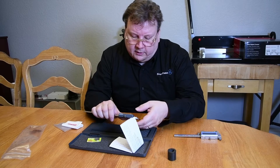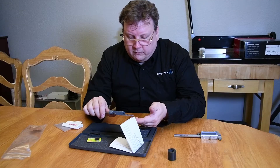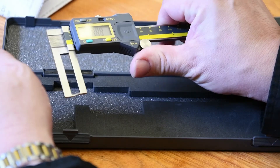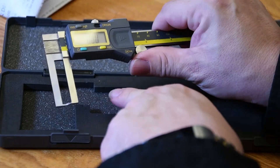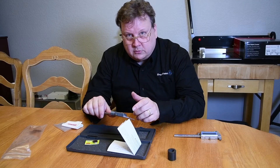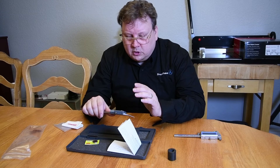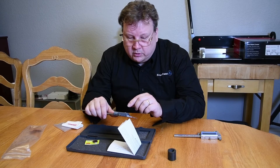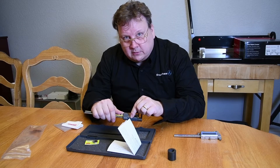The first thing to do is turn it on — that's the green switch. If you go all the way in so that you have point to point, you'll see that it reads zero. This is an absolute origin caliper, so when they're point to point it'll always read zero. You can reset the origin point by holding the origin button down, but it is recessed so you don't do that by accident.